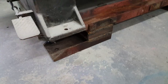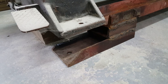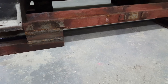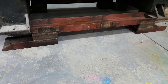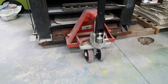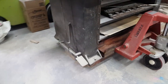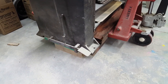I have the cradle pieces in position under the press now, but I still have to take up that five inches of height and get rid of the blocking. I'm going to put the pallet jack under there and try to lift it — I wasn't sure I'd have five inches of lift, so I thought I might have to do some intermediate blocking and lift in stages. Fortunately, the pallet jack does have enough lift, so the press is airborne above the five inches of blocking. I'm just going to take the blocking out and let the press down again.